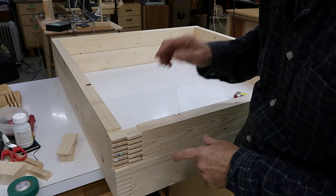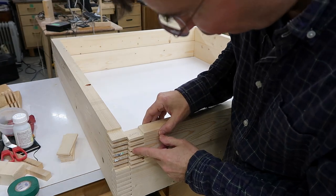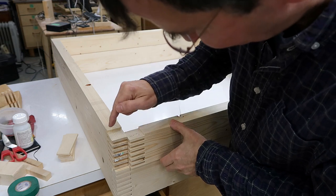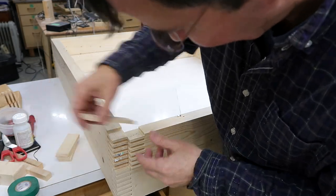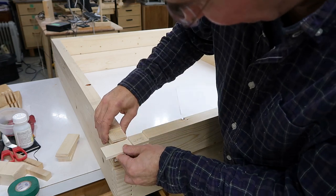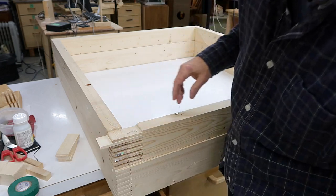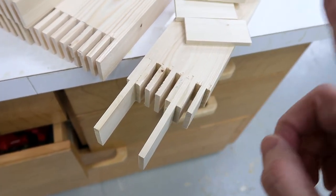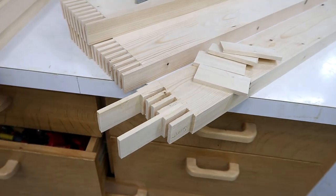Here's a screw up — I cut this piece too short. Fortunately I noticed before I cut the box joint, so I cut this one to match this one instead of complementing it, so that I can put some splines in here and join those pieces like this. I just glued a couple of splines in already, so now I know this is the special one, and it'll help me line it up when I put it together.